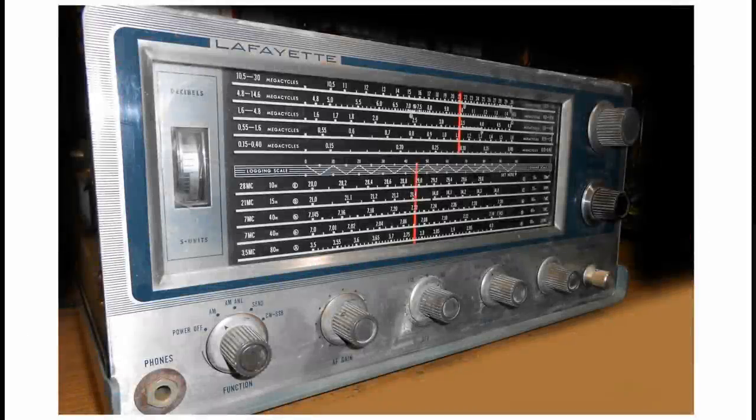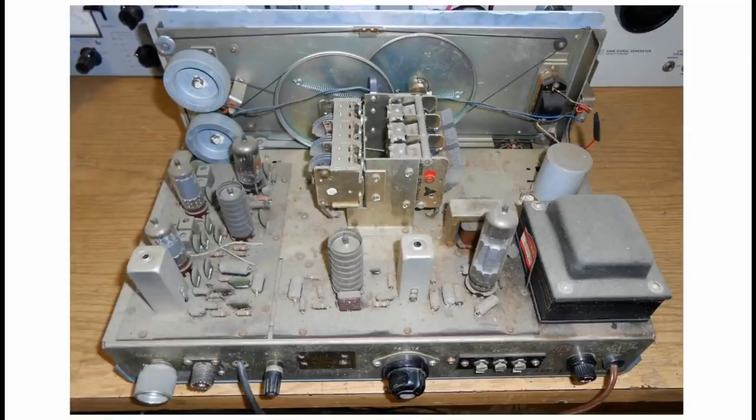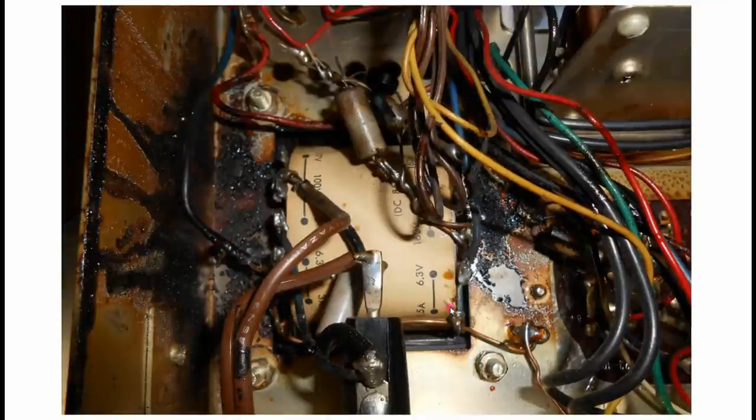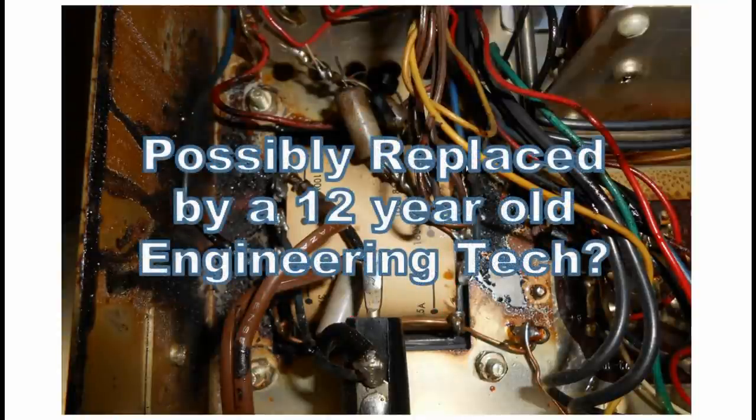It's pretty dirty looking and it's going to need some cleanup on the front panel. Those knobs are certainly going to need some work. Over time the dust will collect, and this radio doesn't look unlike what we might find at a ham flea market or neighborhood flea market or maybe even on eBay. On the bottom there's not as much dust buildup, but it looks like we might have had a little volcano over here in the corner — looks like the transformer might have boiled over. That's going to be something we'll be investigating.